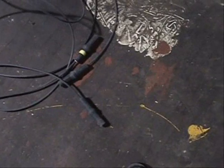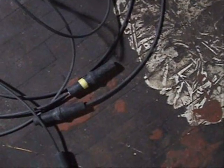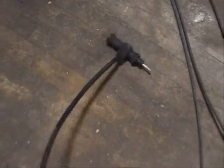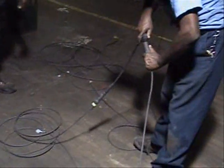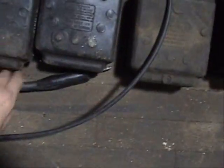Coming from our regulators we have three cables. On the outside we have three male pins, and on this side we have three female sockets. The one we are using for our common return has the yellow tape on it. We take our T connector, which on this side has a male connection, and plug one end from our load bank into the female side of the T connector. We take the female side from our light bank and connect it to the other side of the T connector. This leaves us with two female cables from the outside — we take one and connect the female end to the load bank, and we connect the remaining female cable to the other end of the light bank circuit.